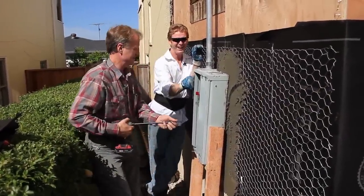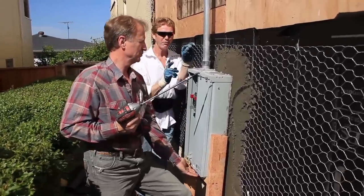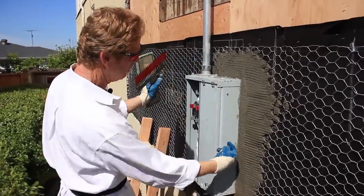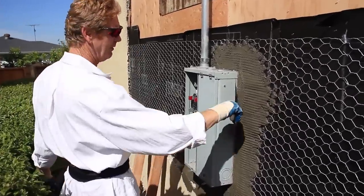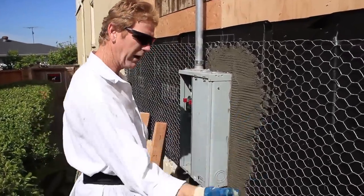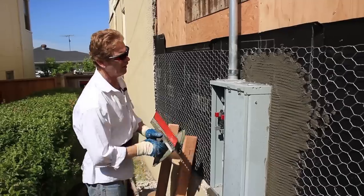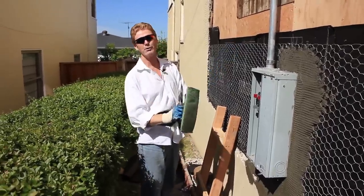Anyway, we've got Roland's level and we're going to put some screws in here. Roland went ahead and fastened this down, and what that did is it sucked this box in, true and plumb. Now all the cement back there is solid and the caulking's mixed in with it. I don't know when we're coming back — sometimes weeks, sometimes months — but I put my key right here. Now I have my scratch coat, so when I come back I put the scratch, then the brown, and I feather into this. I already have my mechanical bond, all the way around it, eight inches around it. We're tied in so that when we place our next finish over it, we get no hairline cracking around it.